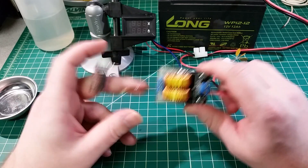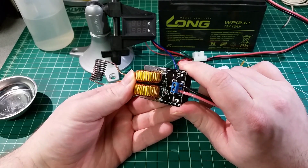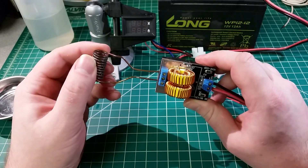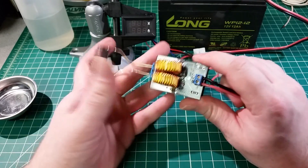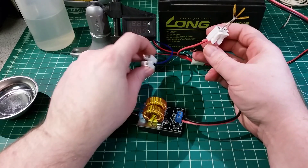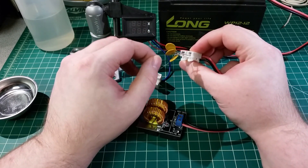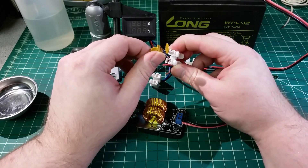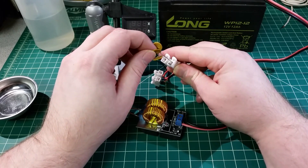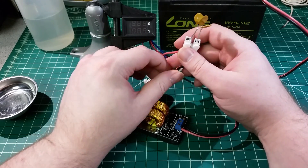His cost him a bit more — this is the smaller, cheaper version. I knew these can be a little bit risky if you don't have some way of limiting the current. You're driving effectively a dead short, and if anything goes wrong you've got MOSFETs dumping power into a dead short and the blue smoke will very vigorously be released. That's why we've got these poly fuses — self-resetting fuses used in a lot of circuits — as a current limiting solution.